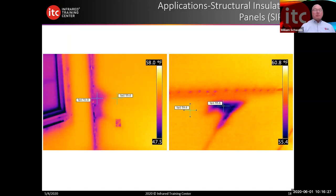Just a little bit about SIPs panels. There's a general assumption that SIPs panels are very tight, and overall they are. But if during the installation process those SIPs panels are not caulked or installed properly, you're going to see some air leakage or air intrusion. The outside temperature here is about 51 degrees, the inside about 55 — we're getting air infiltration through the outside corners of the SIPs panels. I was rather surprised the first time I saw the air leakage occurring at certain locations.